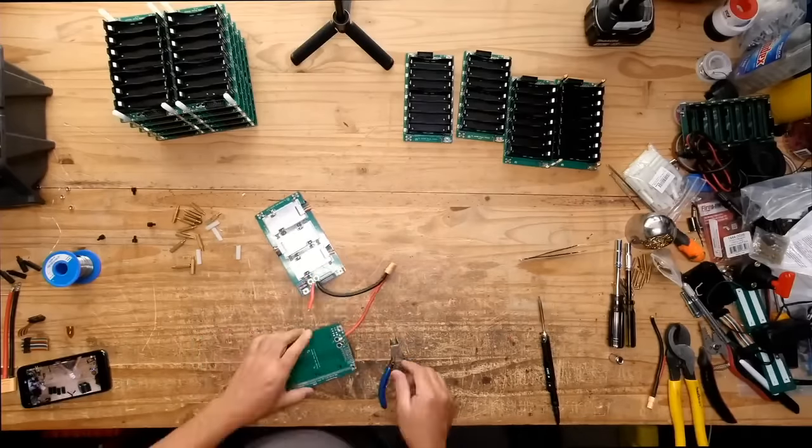So you might want to get your signal from after the BMS. But if you wanted to know the actual voltage of each individual battery group, of the 7 or in this case 14 battery groups, then you would need that cable. So I always end up leaving extra. Most of the time, once you finish a project like this, you just never go back and change it too much. I still haven't perfected these boxes using this system yet, but every time I do another one, I get a little bit closer. I get another idea, like, let me try that, let me do this, and hopefully soon we will have something that is good.